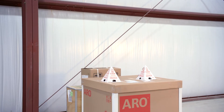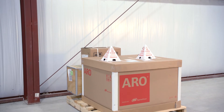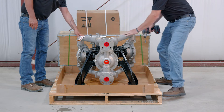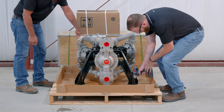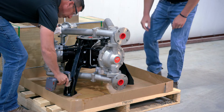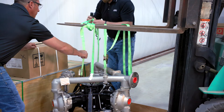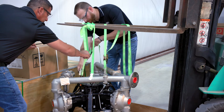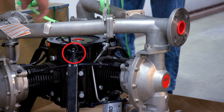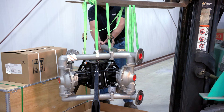Once you have identified the boxes and parts stored in them, you can begin mechanical installation of your new EVO series electric diaphragm pump. First, remove the lag bolts from the pallet. Attach a three-point lifting harness to the lifting lugs located on the top of each leg. Lift the pump off the pallet and place it in your desired installation site.